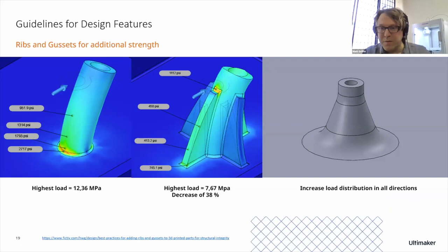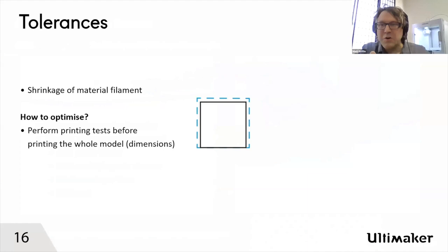There are other considerations that are familiar but used in different ways. If you were designing plastic parts in other technologies, you could add ribs and other ways to distribute load where you join a tall spindly part to a flat surface, avoiding that easy shear-break possibility when you just have a cylinder coming off of the surface.